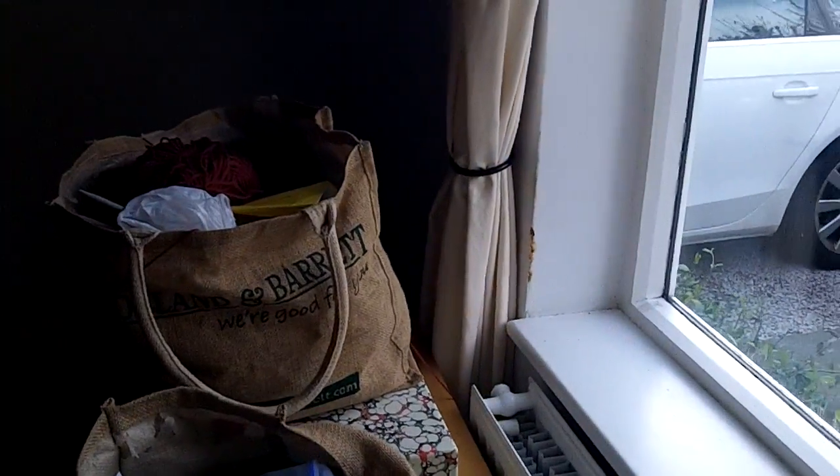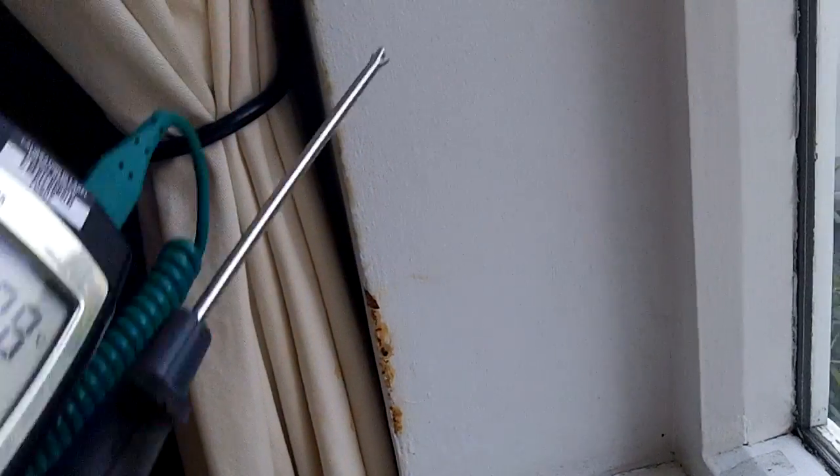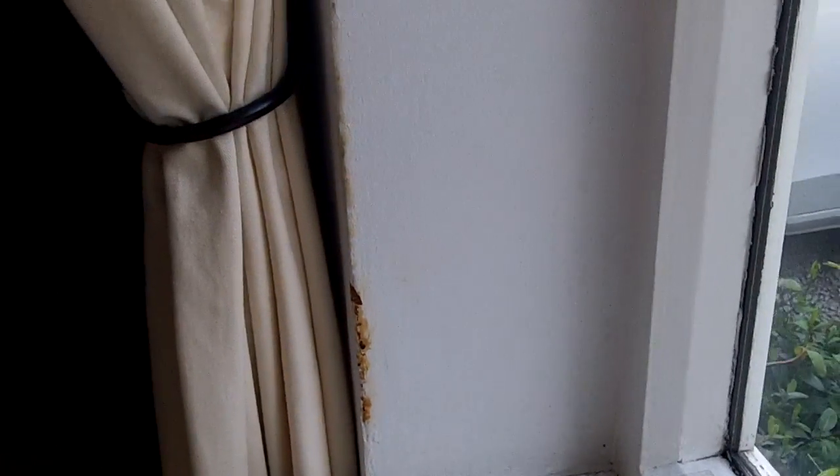You can see it's quite windy outside — everything's blowing. This is a very good illustration of the fact that you get cold exposed corners and cold masonry. Here you can see condensation forming on the windowsill because the windowsill is cold, right in this reveal, and it's actually rotting the corner bead the plasterers used. Again, you've got entirely the wrong thing here — gypsum plaster with plastic paint over it, which is trapping moisture inside. I'll go outside and show you what this is like.